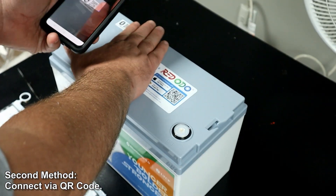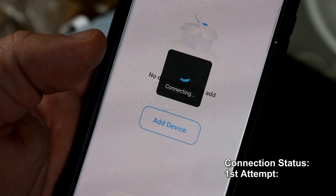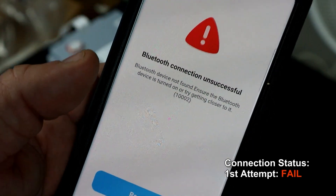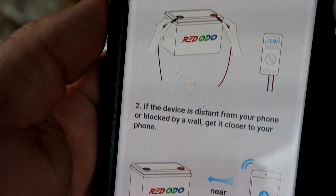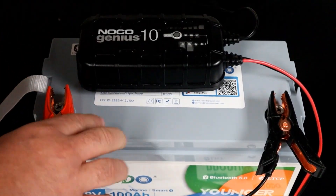So let's try adding via the QR code — it is a different QR code located on the other end of the battery. Scanning the QR code puts it in connection mode; attempted to connect to the battery and once again it failed. So at this point both connection methods have been unsuccessful. Well, I wasn't expecting a hiccup this early in the video, but it happened. I was not able to connect the app to the battery through Bluetooth. Going through the troubleshooting steps, the app said to charge the battery. I stuck a voltmeter on the battery and it's registering 3.2 volts right now, which means it's in the shutoff state from the BMS — the battery dipped below the low voltage threshold. It's not a big deal; we've got the charger on the battery, we're going to get this thing up to 100% and try it again.